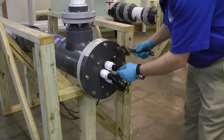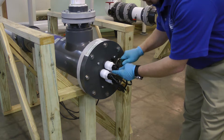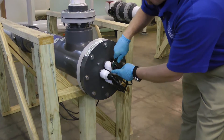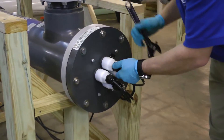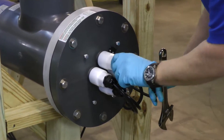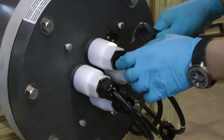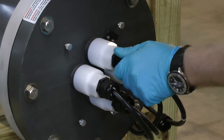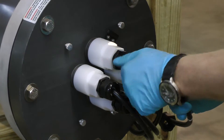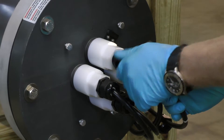Alright, at this point, we're going to go ahead and grab your 10-inch adjustable wrench. You're going to take the outside nut to your watertight connector off. Be certain that you don't twist the cable inside or loosen the white retainer nut. Go ahead and take out the second nut here, loosen it up, be certain that your cable is not being twisted. Remove it all the way.